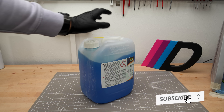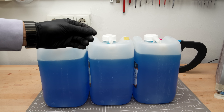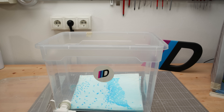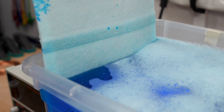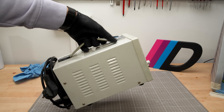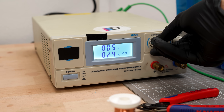Now, electroplating. I've explained this before but let me flesh it out a bit more. First, you need an electrolyte — I almost always use an acidic copper electrolyte because it plates quickly, is inexpensive, and regenerates itself so I can use it over and over again. You need a tank to hold the bath plus some polypropylene filter bags filled with copper — ordinary copper works, but copper DHP works best. I pour the electrolyte into the tank and add a copper plate as the anode. The anode is connected to the positive terminal of a standard bench power supply — any 0 to 30 volt supply will do as long as it delivers a stable current. Sometimes I use a 5 amp unit, sometimes a 30 amp one, depending on the average amperage I need.